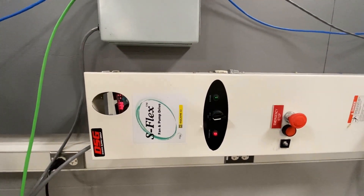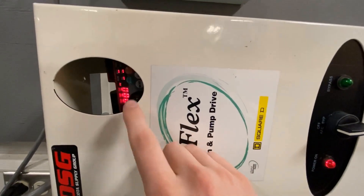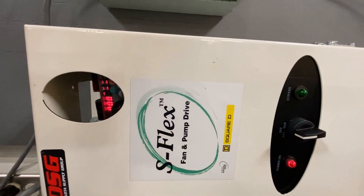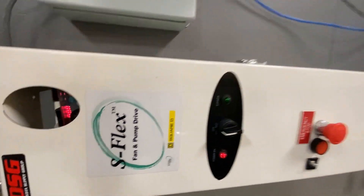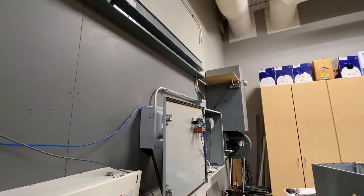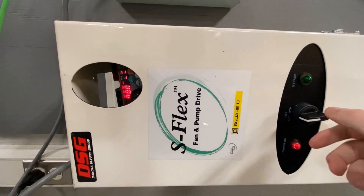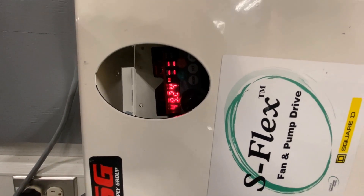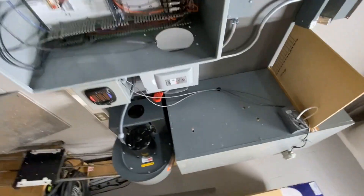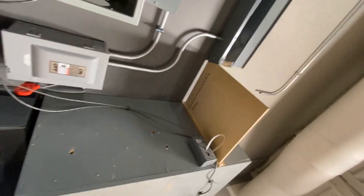To show you the process itself, I'm going to use AFC mode first, which is going to be running with this VFD here. If you watch, you will be able to see the frequency change and ramp up. Right now I got the blockage all the way open, so the motor will have to start running pretty hard at the beginning. I'm going to turn on AFC here. Now that it's up to frequency, I got the motor running, my blockage up there, and my sensor there reading the difference on both sides in the box.